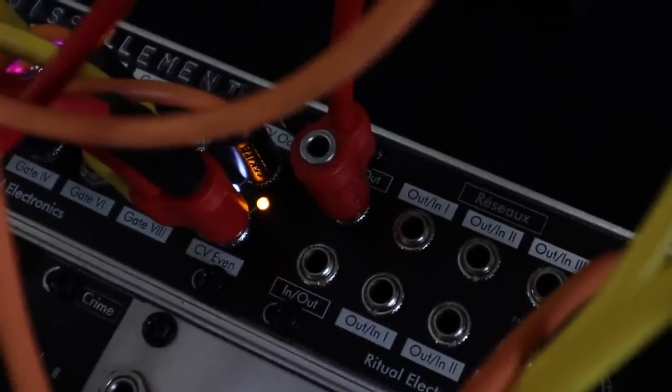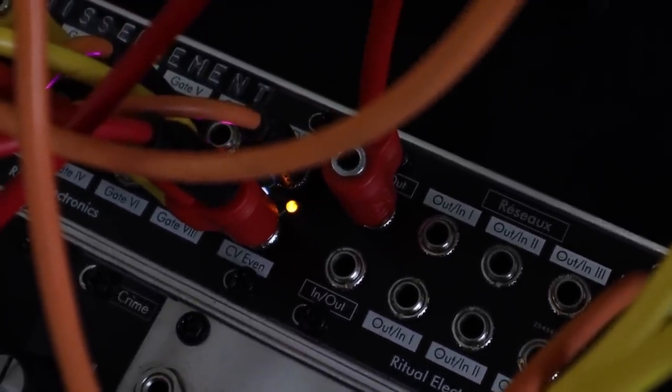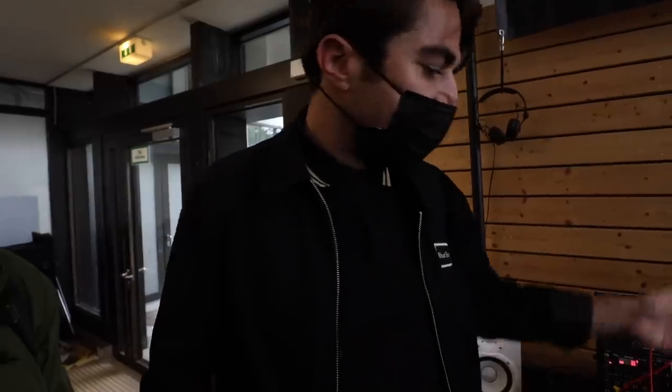Then we have a big 20 HP new module, which is an 8-stage shift register that can work as a linear feedback shift register in the spirit of the Benjolin core to get chaotic patching, or the Turing machine, which is based on the same kind of stuff. It will have an expander board to work with the Turing machine expander.